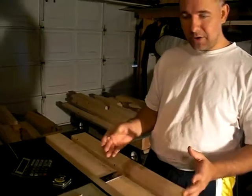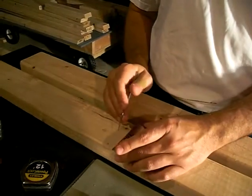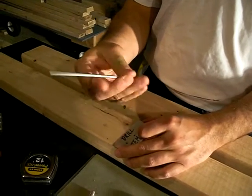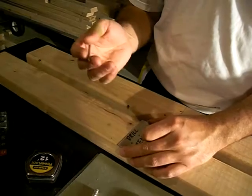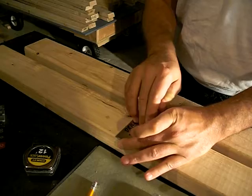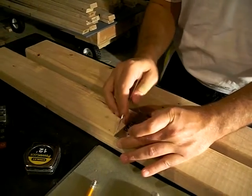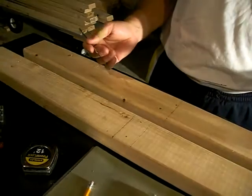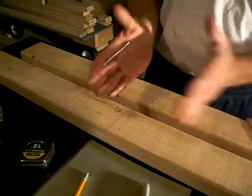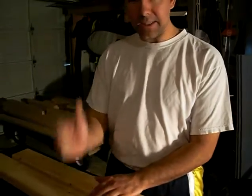If you plan on painting all your pieces before preassembling your walls, instead of or in addition to using a pencil, you can use a scribe. I get these from Harbor Freight Tools — they're kind of like dental picks, but they're great for scribing aluminum and wood. You can scribe that line on each side, and once it's painted you'll still see the indentation of that scribed line, which would provide your perimeter distances for attaching the intersecting 2x4.